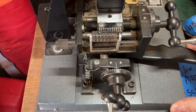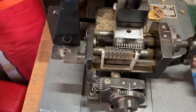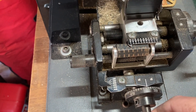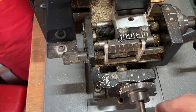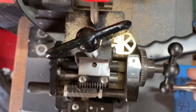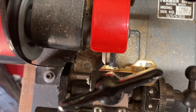And that's what I do. Then position 3 is 0.283 — I'll go ahead and do that now. So it'd be 0.283. This should be... I'll go back here. That's 0.250, 0.260, 0.270, 0.283. And then down one more. It's hard to do this while looking at the camera at the same time. Alright, so that's the Quickset cut without doing any of the width widening.